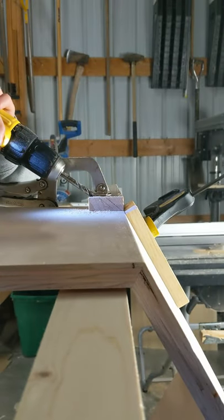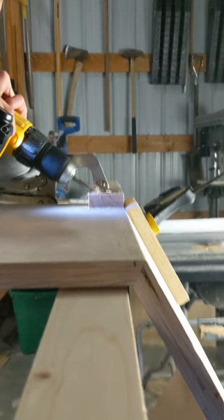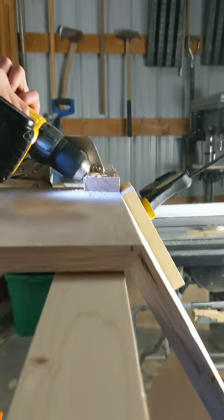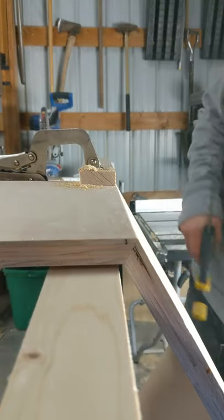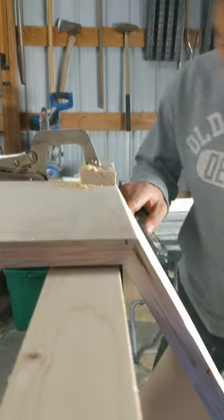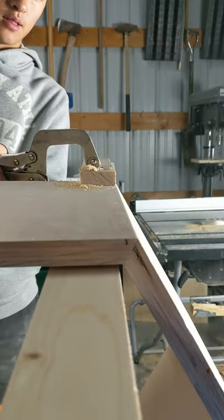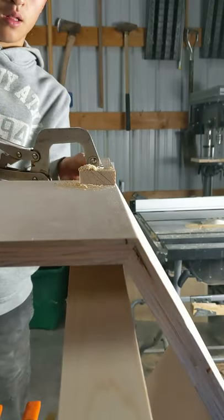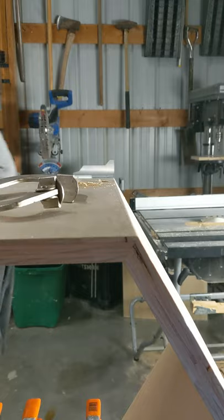For this part, I know that just gluing the edge probably won't really hold the hexagon together — it won't be strong enough if you put stuff in there. So I went ahead and made a jig at a 30-degree angle, drilled holes all the way through. You can see I clamped that jig onto the hexagon, then drilled a 30-degree angle hole right through it. That way in the future you can put a dowel rod in, which will help make it more secure.